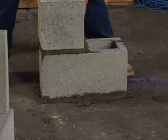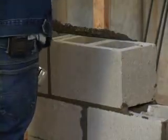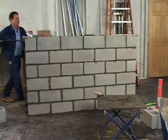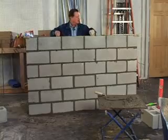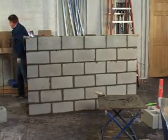Right on the line. Now that I have that wall in, we'll lay in our horizontal steel. Since the wall is finished, as high as we're going, and drop the vertical bars.